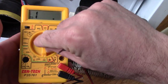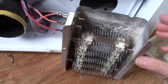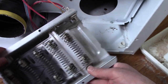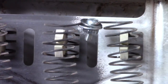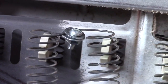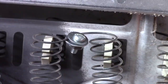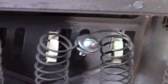This is the bottom of the barrel as far as quality goes, but for tests like this they're great. So assuming there is a break in yours, I'll show you one little trick that might work. This I learned when I used to have an electric kiln - if there's a break in the coils, you can attach them together with a nut, a bolt, and a couple of washers. It works great, especially if you have washers with a bit of grip - the ridged ones will hold it and it'll work perfectly, hopefully saving you time and money from buying a new one.